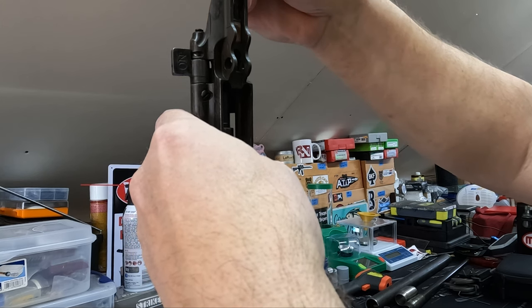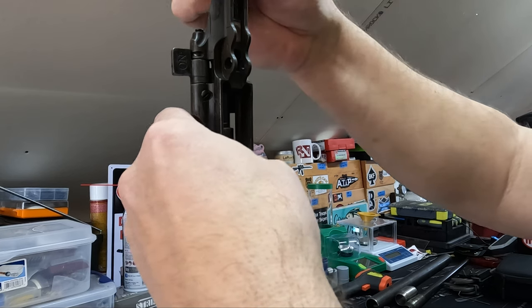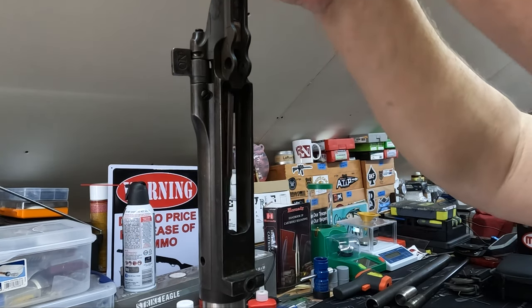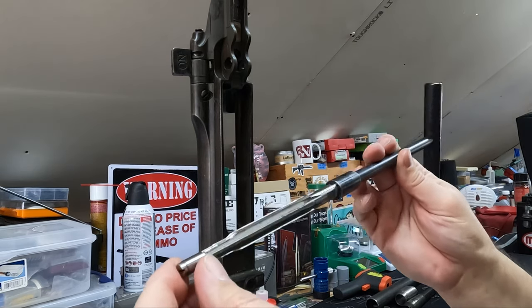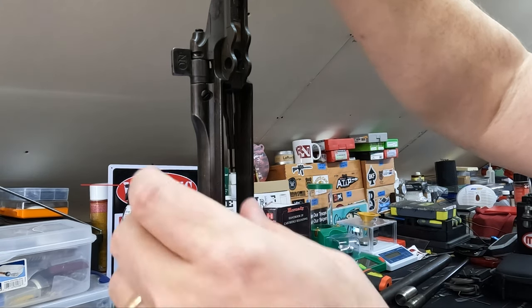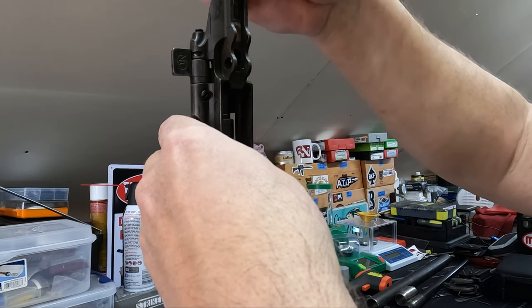So I'll just leave just the weight of this handle for now, and just turn a little bit, back it off, turn a little bit, and then we'll see how much we've removed. Because I don't think it'll be too much here at the beginning, but we're going to be very, very careful. Now we'll look for chips. And there are just a very, very few chips. So I'm sure that's not nearly enough. We'll turn it just a little bit more, and we're going to flush it and check with our go gauge.